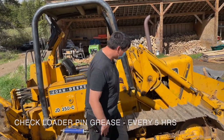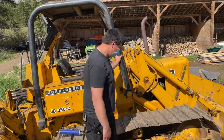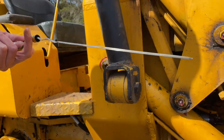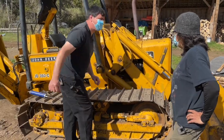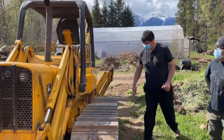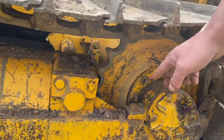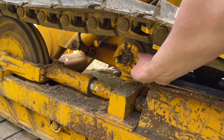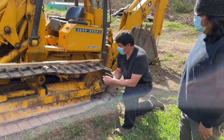The next one that we're going to check is your motor oil. Really important because you never know when your oil pan might get damaged or something comes loose and you might be losing oil. We can see that our oil level is good. On this side, we're just checking the same things, our grease fittings. You've got your main hub here that is filled with grease instead of oil. You've got an idler wheel there that is greased and then you have your track tensioner. Those are your grease nipples on this track side.